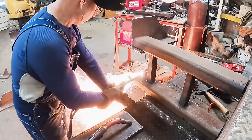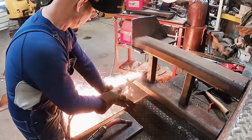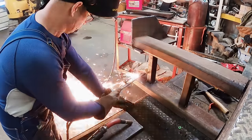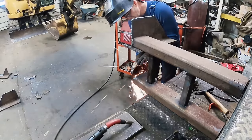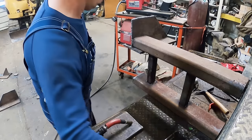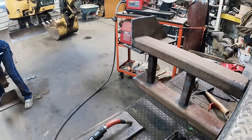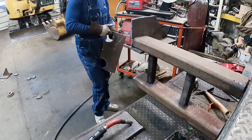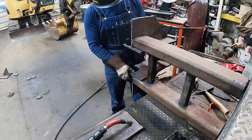The pins the pin grabber grabs have to meet with the cutting edge, so to speak, for lack of a better term in this situation. It's got to all meet up right. So you bring your thumb down, you grab a tie or something, everything meets together. But you don't want to take every single piece of the build and make every single thing exactly perfect, because most of that stuff you're never going to see. If it's off a 32nd or 16th, you're never going to see that in a million years using this thing. What matters is the business end and where the pin grabber goes.